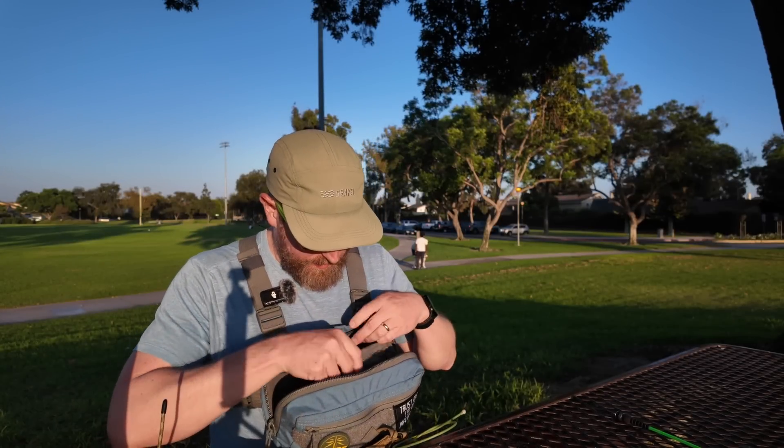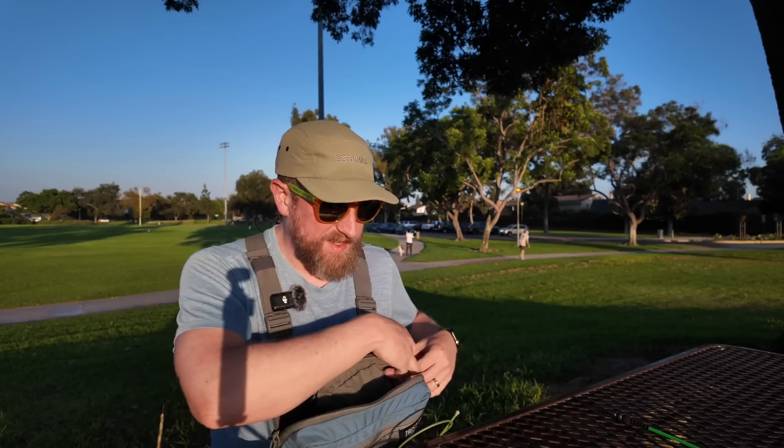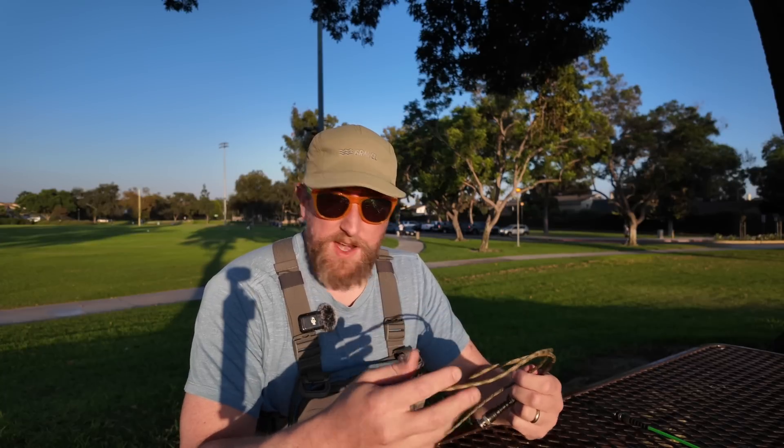My opinion on these antennas is probably not that important, truth be told. There are a number of guys actually in the military who are in situations where they need this type of antenna — particularly the Cattail-type, a routable antenna that's not going to get in the way, that can weave through webbing, that can be very low profile. And in fact, that's kind of what they want their performance to be in some cases too — they're not looking for the most effective transmitter. A lot of times you may not be running all that much power if you just want to talk to guys in line of sight with you — maybe a block away or even in the same building. You just need to stay in communication. Something like this is useful for being able to have it on your person, make your radio happy, but also something you could use if you got up to a certain location and maybe strung it up or held it vertically.